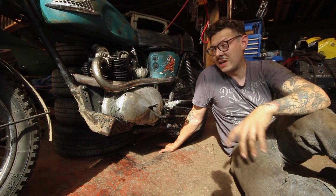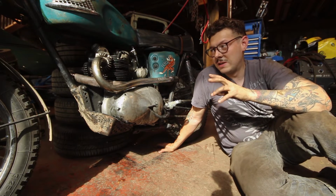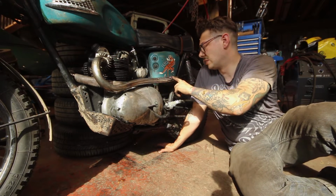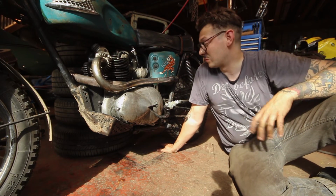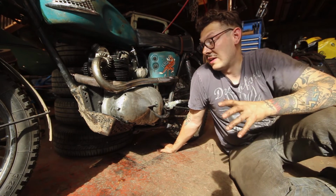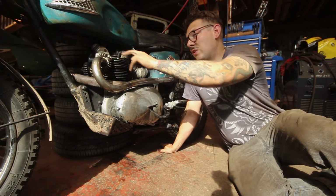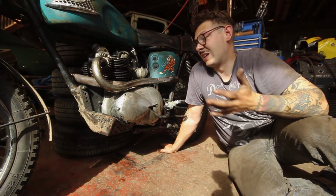Okay, so the cutting and shutting actually worked a treat. I did it twice just to get it down a little bit more on diameter, and you can see now it's sitting really quite nicely. I know it's pedantic, but it also shows the little SS I painted on as well. So that is great. The important thing about this is that they sit on the stubs square, otherwise you're not going to get a good seal, and that's just not very good.